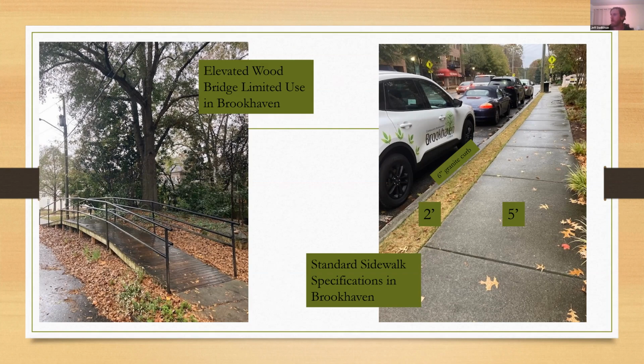So our specs, everyone in Brookhaven, the curbing is granite. And if you've never seen this stuff installed or reinstalled, it is the 6 inches above ground that you can see that make up the visible part of the curb. It's incredibly deep. It goes almost 18 to 24 inches into the ground. It varies a little bit. But these are massive slabs of granite.